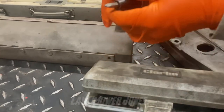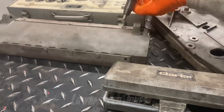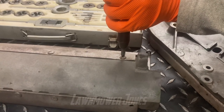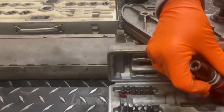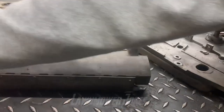Ideally you'd have soaked these screws in oil weeks before. You could use an impact driver whether it's the bottom blade ones or the thrower plate ones — you hit it and make sure you're going in the right direction to undo. That's one option. But I don't really want to bang that because you can see it's very fragile and I think I'd just make it worse.